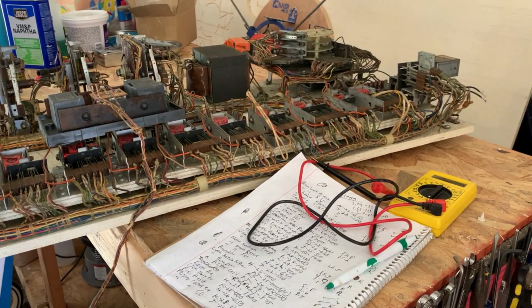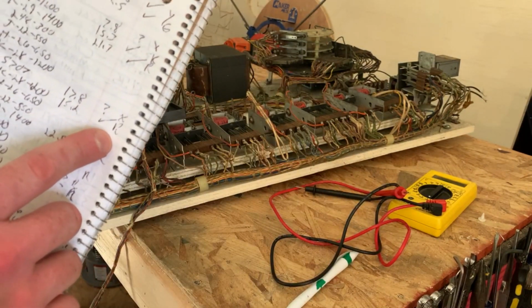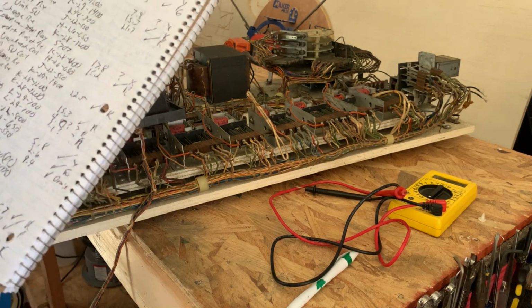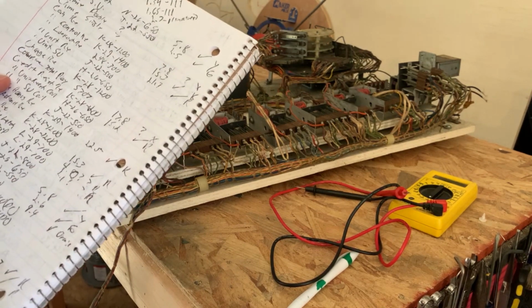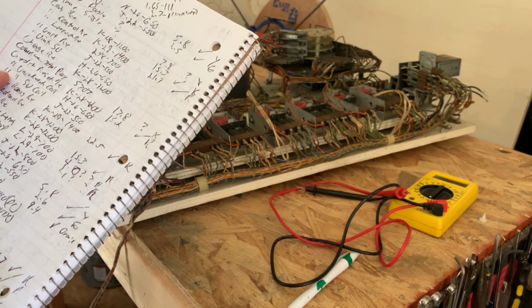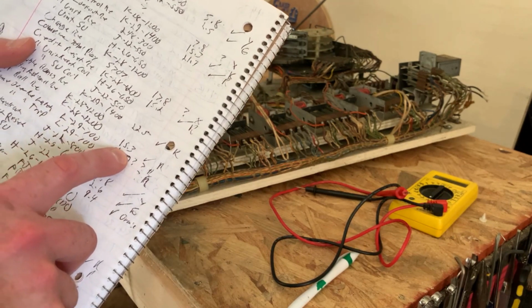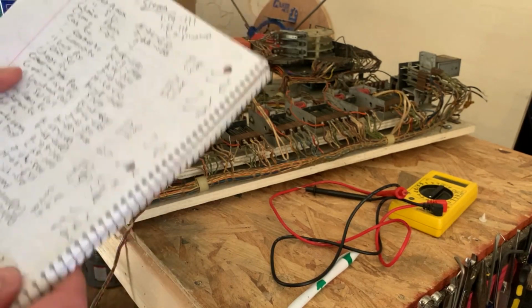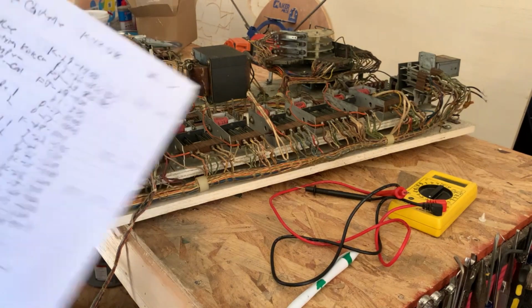Alright, so I've done them all on the mech board here, and you can see, just kind of write down the resistance, coil sleeve color, in case you have to make new ones and they get all ruined, and just keep track. And you can kind of tell, once you do a few of them, what they're supposed to be. For example, K28 1200 tested 15.3, K28 1200 15.3. So I didn't have any that were really suspect on here, so it doesn't make for a good example.